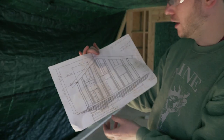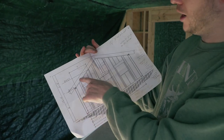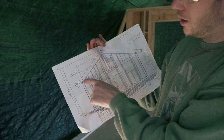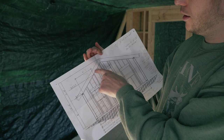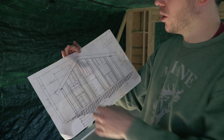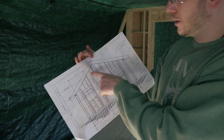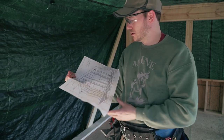Now I'd like to draw the outline of my wall on the subfloor and locate exactly where my ridge beam is going to be. I know the size of my ridge beam and I'd like to use a chalk line to mark it up — that will give me a feeling for the size of the wall and help make sure everything fits into place once I put my studs in. Let's see if I can find a way to locate all that and run some chalk lines.